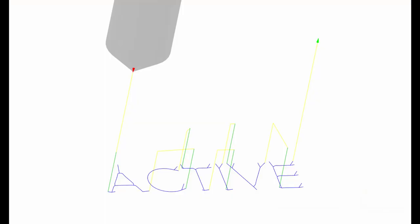This is what I'm using for the engraving — a normal two-flute chamfer mill that I use on aluminum all the time. It's a Lakeshore Carbide two-flute 90-degree chamfer mill. You can see in the toolpath these little squiggly hairs coming off the ends of the letters. What those are doing is bringing the tool up in Z as it moves to a corner, which gives you a nice sharp edge because just the tip of the chamfer mill is cutting at that point.